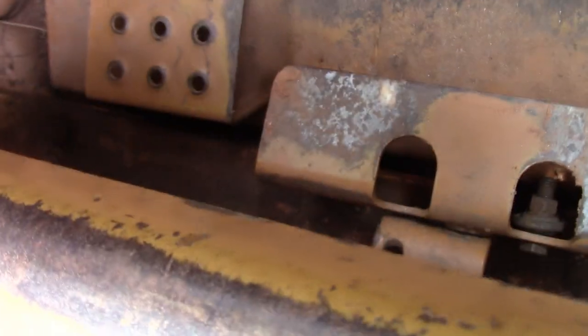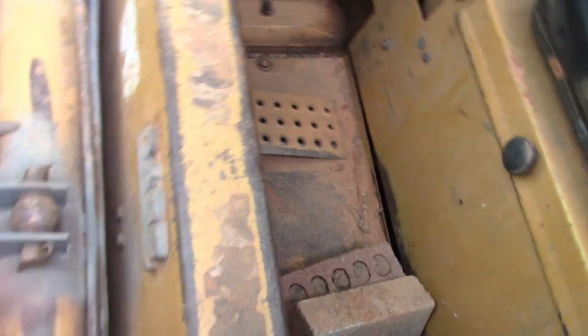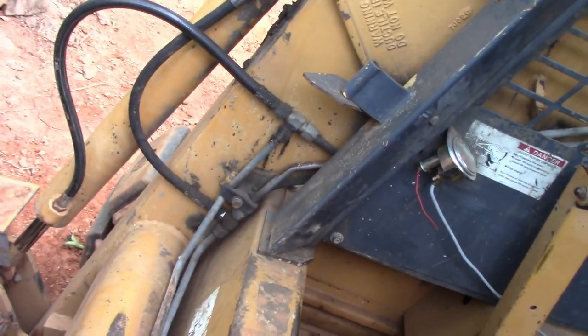Pretty simple stuff. The main thing with one of these backhoe attachments, at least this one, I don't know if all of them are this way, I think they are, is you have to have constant auxiliary flow. So this machine's not set up for that, unfortunately. But what I did is I just had a brick stuck underneath the pedal, and I ran my backhoe off of it, and it worked pretty good. All right,